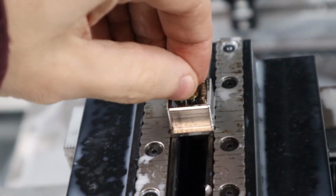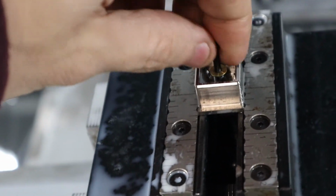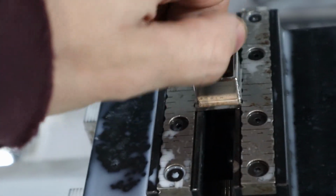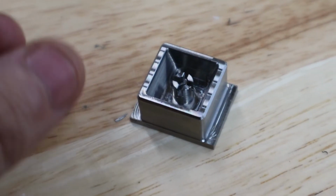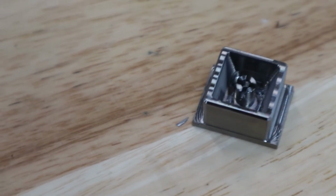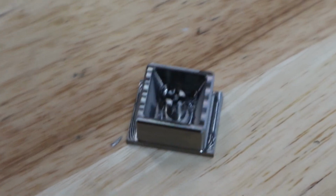Cool, so I just bumped out the cutter comp a little bit and it's now perfect, so that's good. Goes in there without any resistance, and yeah, so this should work perfectly. Alright, cool. I just checked it, remeasured it, recontoured. I ended up cutting 5/10 radially, so a thou all the way around, I think, is what that means.